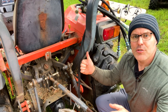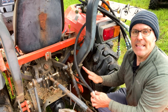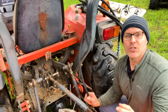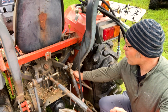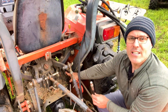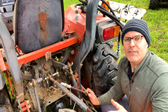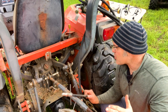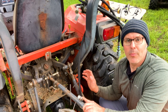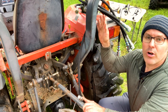To connect the spool valve into the tractor hydraulics, we have a hose coming off the P port — the pressure port — and that plugs into the port that provides power from the tractor. On a Kubota, the female port on the tractor is the power port and it returns to the casing through the male coupler and hose. If you don't have backhoe connections, the power port will be the long hose coming from your power beyond port on the loader valve to the P port on the spool valve.